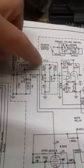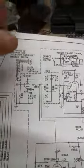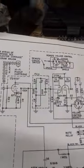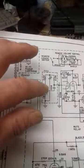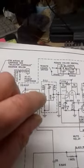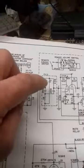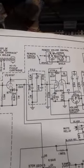going straight into this little PEC, which is an encapsulated circuit. All those little components are encapsulated in some sort of compound years ago. Makes a very small component with all those little things inside of it. Very early form of integrated circuit. Well, those break down. They can sometimes short out, or the components can drift off value, and as this is a tone correction circuit, it does affect the sound of the amplifier greatly. So best to rip that out and remake this little circuit on a piece of board, which is what I've done, and I'll show you under the hood and you can see exactly what I've done with that.